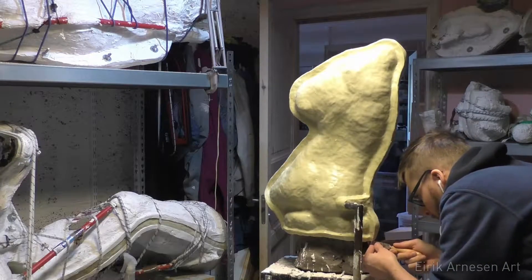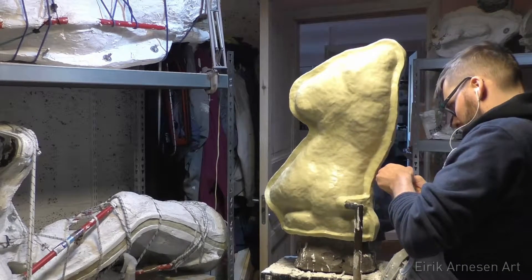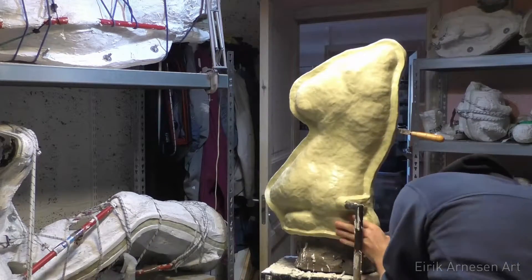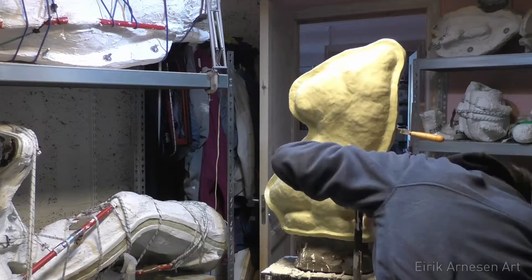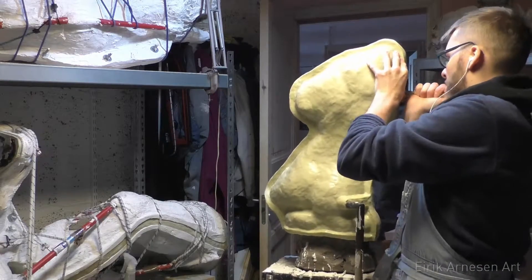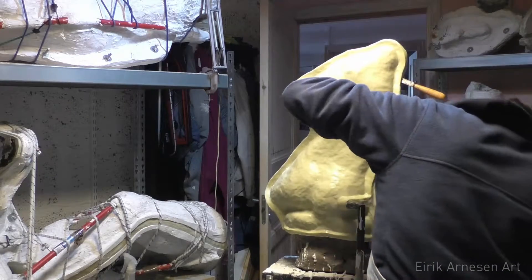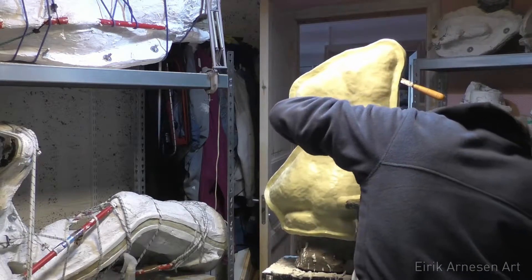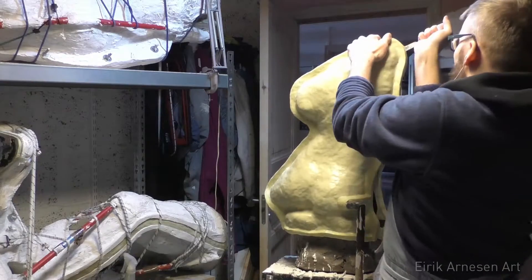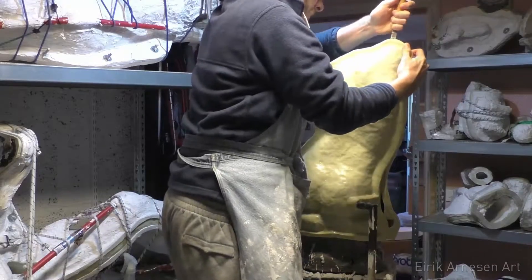Here's an interesting part: I'm going to cut the silicone apart using my mold knife, which Thor Larsen bought for me in Pietrasanta — very nice of him. It's pretty cool to have a tool from one of the original marble carving towns in Italy. This knife has a trench in it, so it creates a positive and a negative with a little bend, meaning that once the two separate sides of the silicone are put together, they register really nicely.